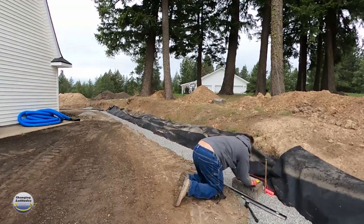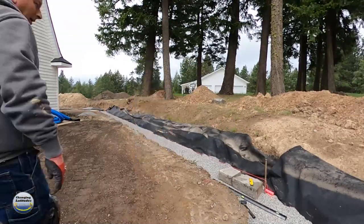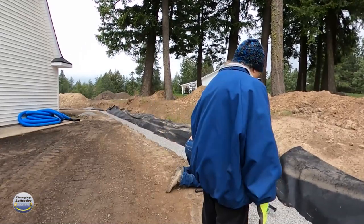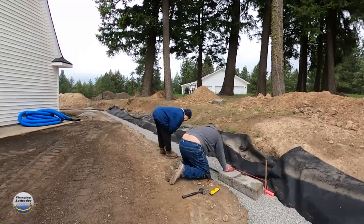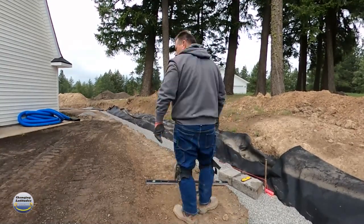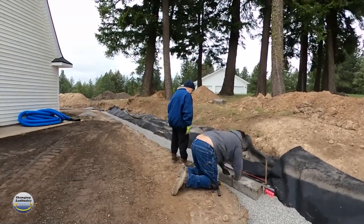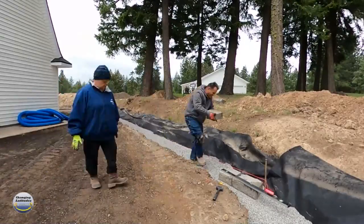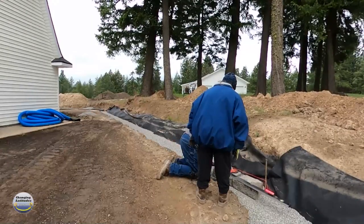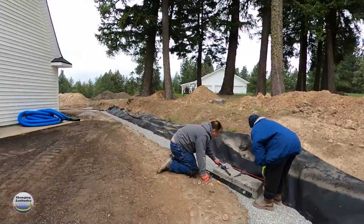The base is 3/4 clean grade A rock. On top of that, just so that I could level a tad, was some 1/4 inch clean basalt rock so that I could easily pound it in. One of the mistakes I made in this phase was not using a large enough dead blow. Ultimately, I purchased a dead blow later on that would drive it into the ground easier so that we wouldn't have to kill myself along the way.